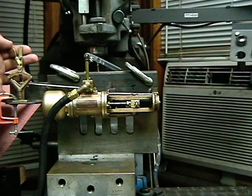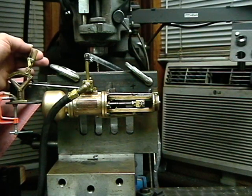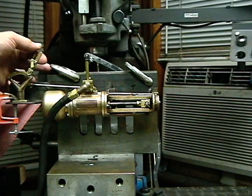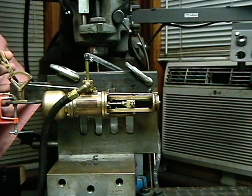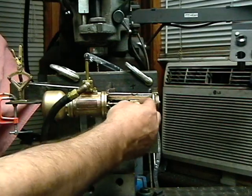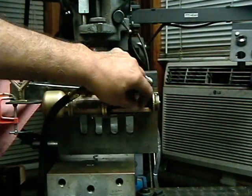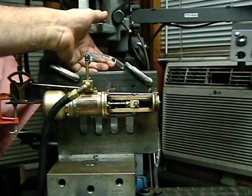This is going to be the operation of the reverse gear. At the moment it's in center. As I move this forward you can see it slowly moving in proportion to my movement of the quadrant, and then as I pull it back it comes all the way back, then I went back to neutral again to center. You can't really push on that too much — it'll hold quite a bit. There's about 80 pounds pressure on this right now.